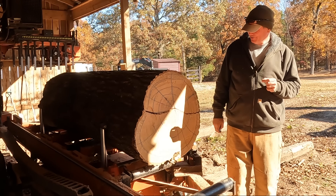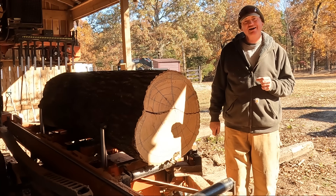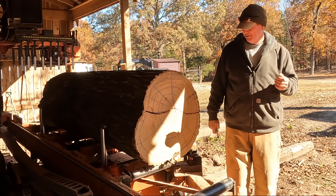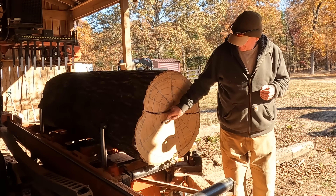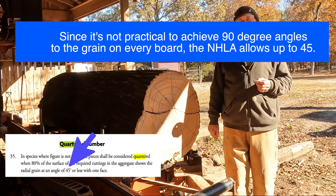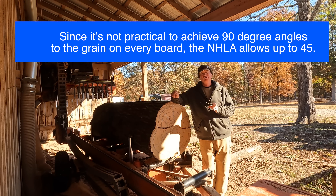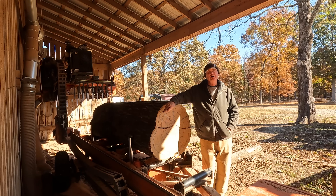For example, if you're sawing perpendicular to these growth rings and you're not aligned with this crack, you're probably a little bit off target. If you happen to be sawing a board at some crazy angle, that ain't going to be quarter sawing. The idea is that no matter which technique you use — old school, conventional, off the bottom, it doesn't matter — use these lines as a guide.